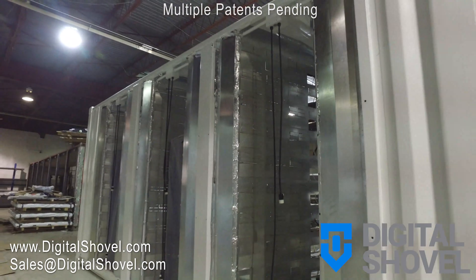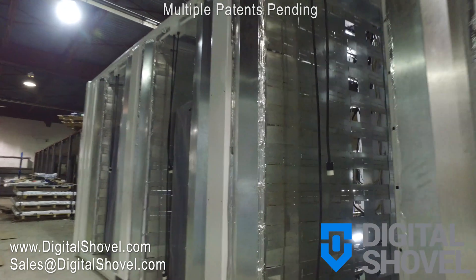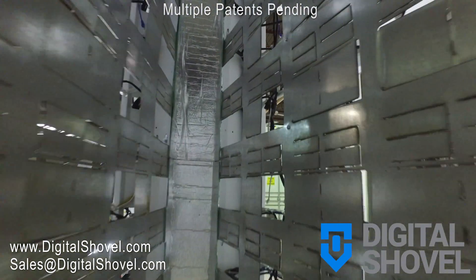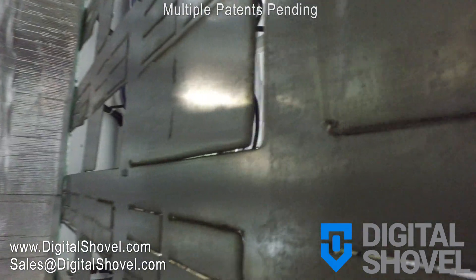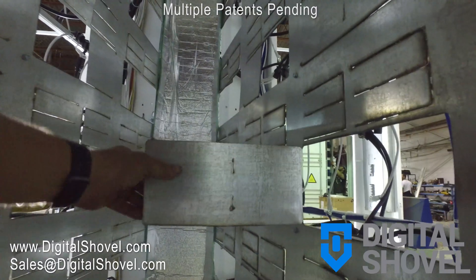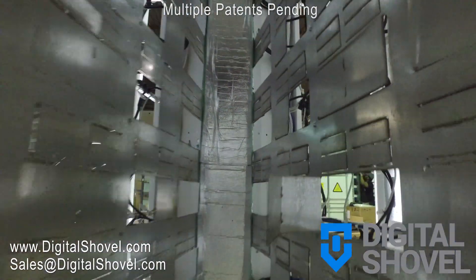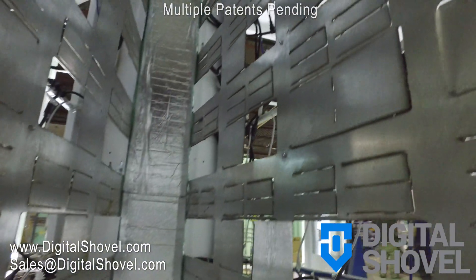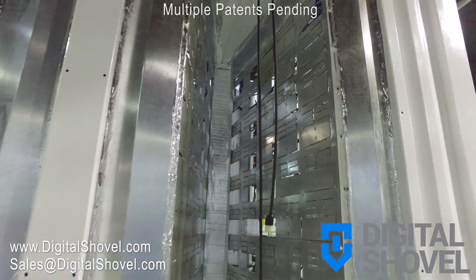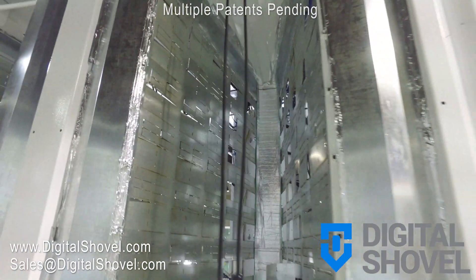This is our hot side. We have three frames that bolt on to the outside here and six fans totaling 164,000 CFM to pull that hot air out. The flaps get bent back like so, and that helps to deflect and shape the hot air out into this area. These twist locks are 220 twist lock power cords which feed your fans.